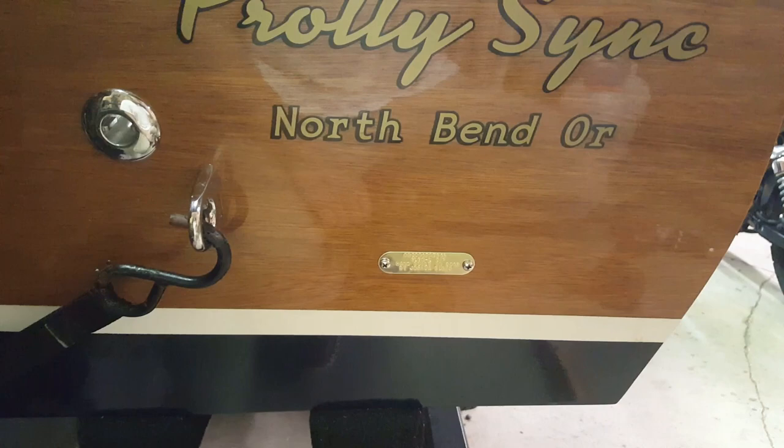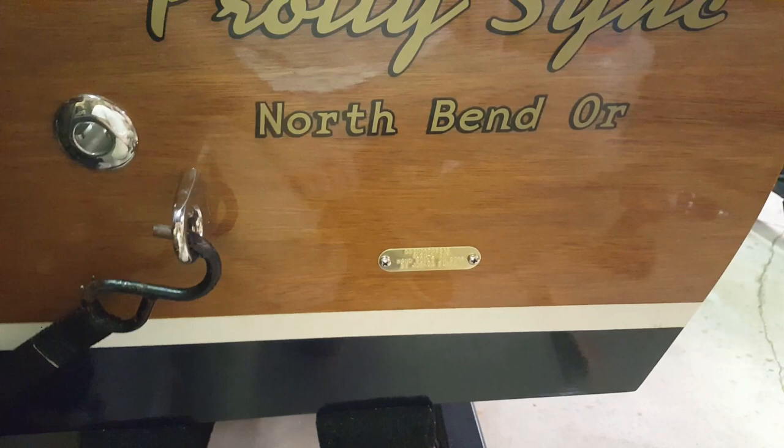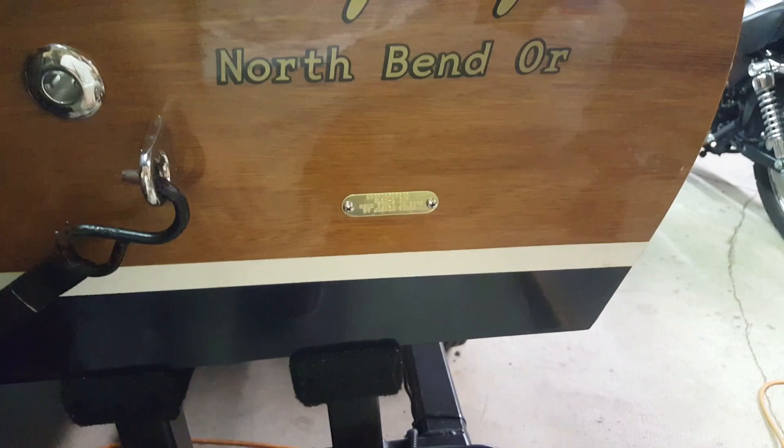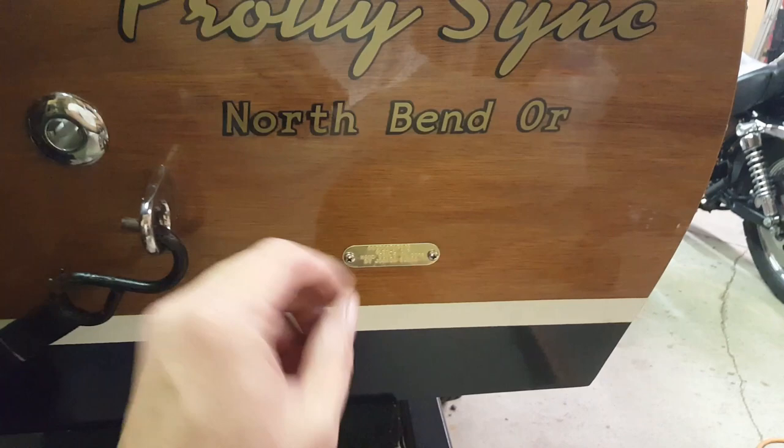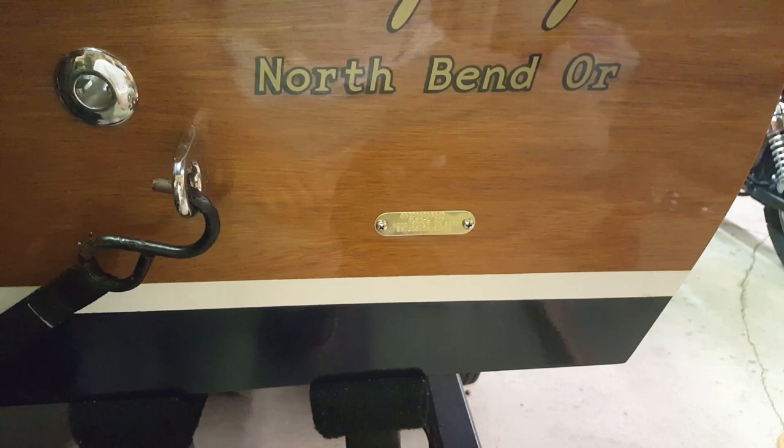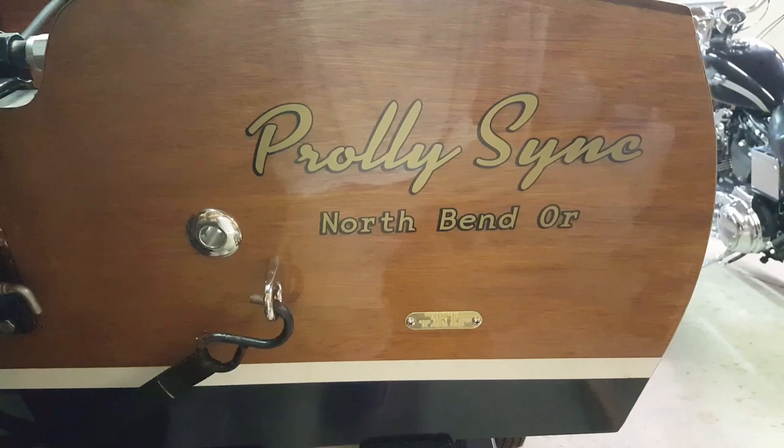So I put that on the screws, ran them in, snugged it up. Of course, it squeezed out, you know, around the corners and around the screw heads. One thing to note is that 5200, the 3M 5200, cleans up very, very easily while it's wet with rubbing alcohol and/or denatured alcohol. So a little bit of that on the rag and it just wipes right off nice and clean. But if you don't, it's not coming off when it cures up. So one more thing off the list. I think it looks great.